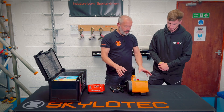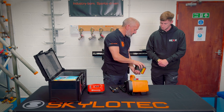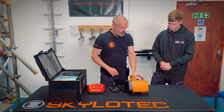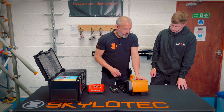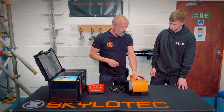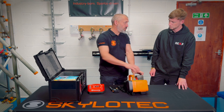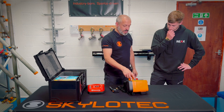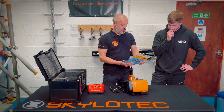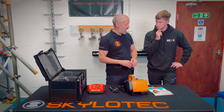So we do a pre-use inspection — we check our battery terminals, check our battery, make sure nothing's broken. We've still got the power indicator so you can see it's fully charged. When it goes in, it has a double latch — so it's in but it won't come out. I have to push it down firmly and it'll click in; it's now fully located so you can't drop it, you can't accidentally open it. If you have to open it, you have to pull both sides — it's a double button and a double stop to get it out completely. We make sure our e-stop is out and then we can turn it on. All the lights light up; it's all explained in your user guide. It's far more advanced in its management systems than the ACX because it's a newer machine.